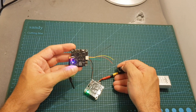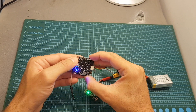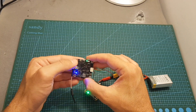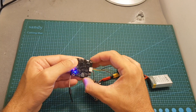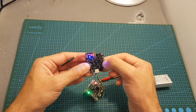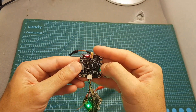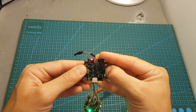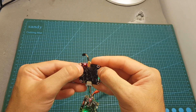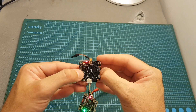I'm now going to power up the VTX with a micro SD card inserted. You can see the LED indicator — when it's flashing it means the DVR is recording, and it auto-starts when you plug in the battery. To stop it, press the DVR button again. To unlock the VTX, long-press the VTX button for 10 seconds. You can verify the unlock by pressing the VTX button for five seconds — the LED flashing slowly confirms it's now set to 200mW.